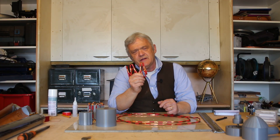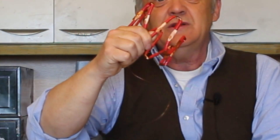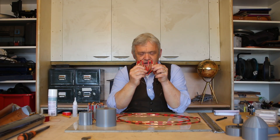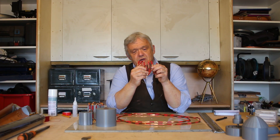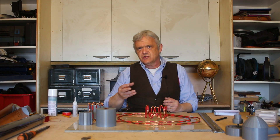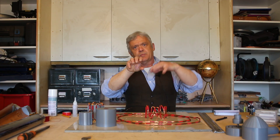When a wire generates, it generates most efficiently when it's in a straight line. As we turn it around, we lose efficiency of generation, so we want as much wire as possible going through the magnetic field in that direction. An ordinary coil goes round and round and has a top and a bottom, whereas a serpentine coil only has a top or a bottom — so we've reduced the weight of copper for the same generation, and the energy density goes up.